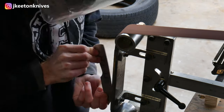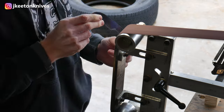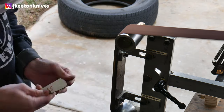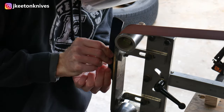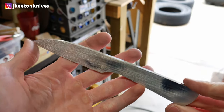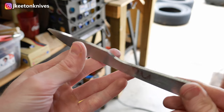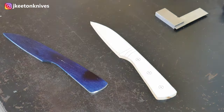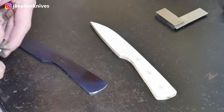We are profiling this knife out on an old 60-grit belt. I like to not only get it profiled on the table there, but also to finish profiling along the spine, looking down the spine, so that I have all my scratches going in the same direction and the spine perpendicular to the flats of the blade.